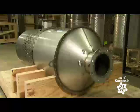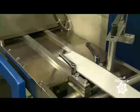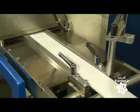This self-cleaning diesel filter traps engine exhaust soot and burns it off by heating the filter elements. This effectively completes the combustion process. At the core of those filter elements are heating strips made of steel fiber, which is like dense steel wool. But the steel is a special mix of alloys resistant to high temperatures and corrosion.